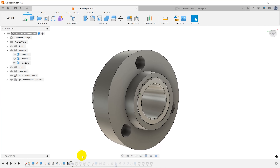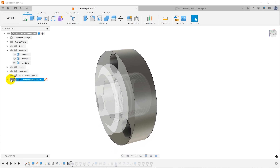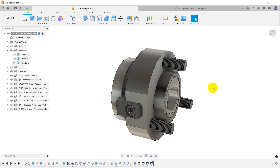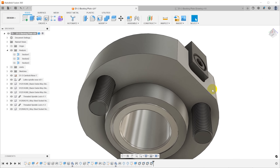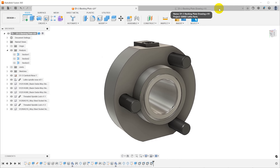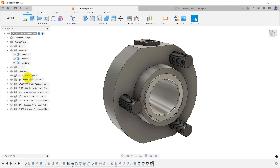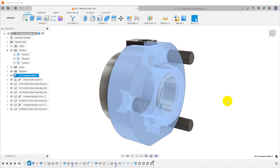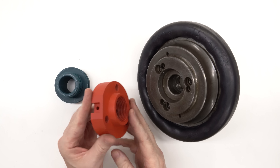We're working with size three, so the large end of the taper is 53.975 millimeters, and all the other necessary dimensions are in the table. I started by creating a sketch using those dimensions, then extruding and extruding with a taper angle to create the geometry on one side, then used hole primitives to create the dimensions and geometry on the other side. I also added flats on the sides — handy when machining and useful for holding in a vise.